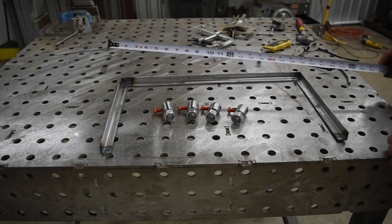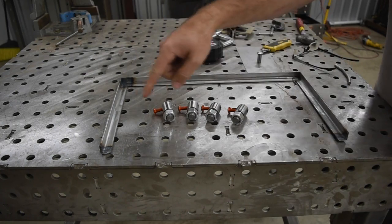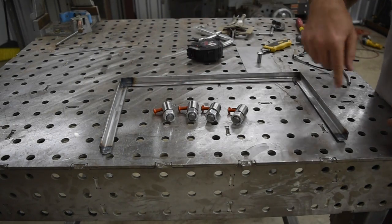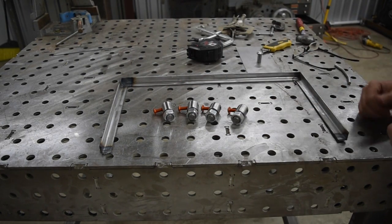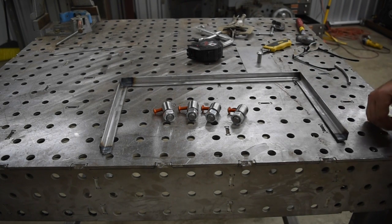You can see, an inch off between here and here. And this is pretty common for this unsupported edge out here. If this were to be a square frame with this fitted in, you'd have a lot easier time because you'd tack all this up and the frame itself would help hold it square.